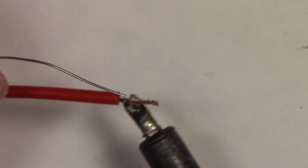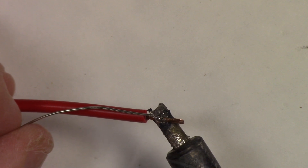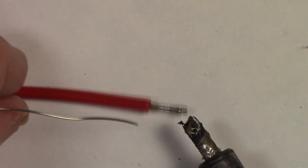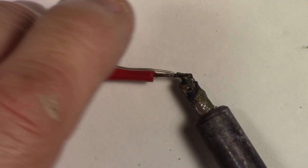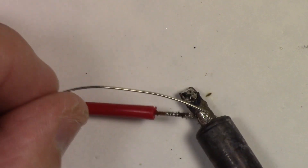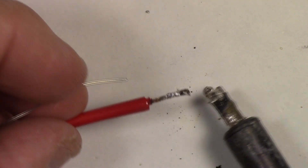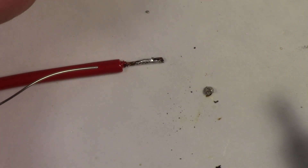Here's a closer look at the tinning process. I heat up the wire and then put the solder onto the wire, letting the wire melt the solder. Use lots of solder — it doesn't hurt. The solder will soak into the wire and make it nice and stiff and very conductive. There we go — you can see what a nice coating of solder it has all the way through. Next we're going to put these onto the actual holder itself.